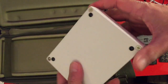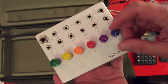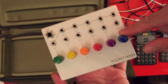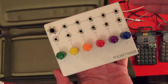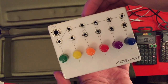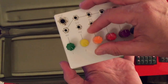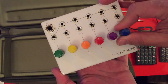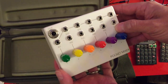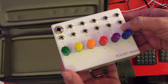This is an entirely passive device. I'm actually working on an active version now, because with passive devices there is a volume drop in the way input signals are summed — though there's also zero additional noise. The active version will have a 9-volt DC power input, and these volume controls will be able to provide unity gain as well as a little bit of a volume boost, which is helpful with the pocket operator series since some of them need more volume boost than others.